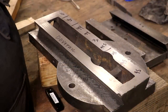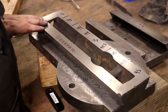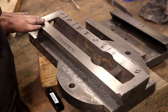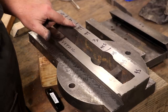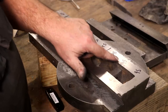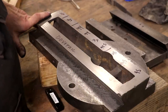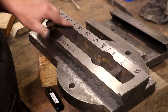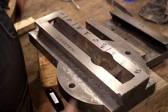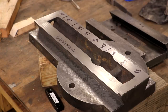After step scraping, I went back and rechecked everything and we got a little bit different pattern this time - we actually made some headway. We had about three thousandths total difference before; I'm down to about two thousandths now. Things are a little bit different - my highest point is up here on the end at 96, but it's only for about the first inch and then it drops down to 95 and then roughly runs 94 all through here, and then on this end it jumps back up to 95. So basically high, highest, high, low. We're going to do step scraping again - probably just one pass back and forth each time. I'll start on the 96, then do the 95 here and here. I'll keep continuing the step scraping until I get it right and bring you back.